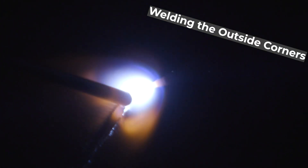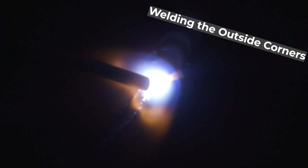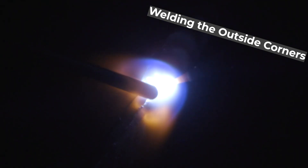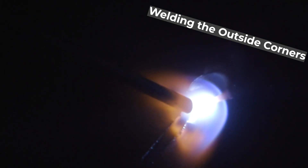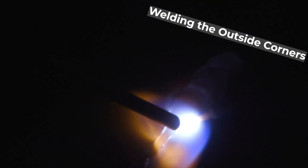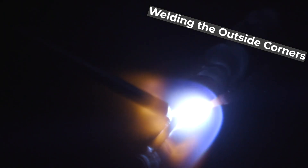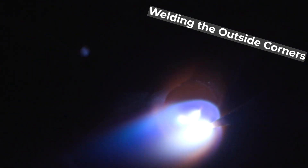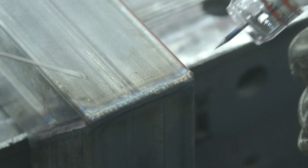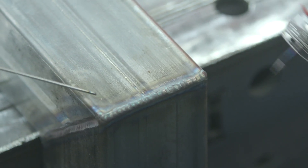On the outside corner, I'm 90 degrees down and I drop the filler on top of the weld instead of in front of it. That controls your heat a little bit more, especially on thinner tubing — the 16-gauge, 18-gauge, and 20-gauge. It gives you better puddle control and you can see better where you're going and how heat is carrying over to make sure you get nice penetration. You're using gravity to your advantage, dabbing in that way.